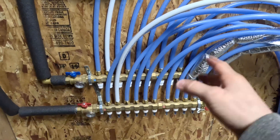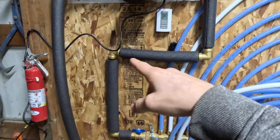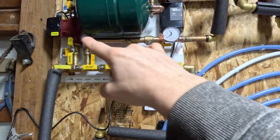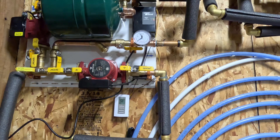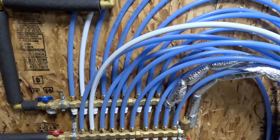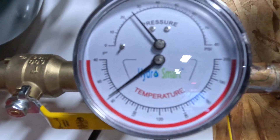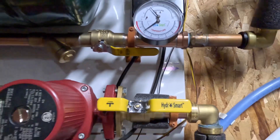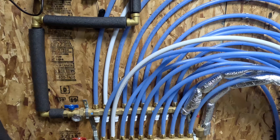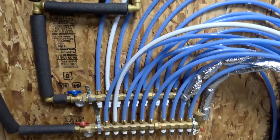I had to re-bleed all the snow melt lines that go into the concrete individually — shut those off, bled the whole manifold, then did this loop here, shut all that off, did the main loop up top. I did all that about twice to make sure all the air is out. She's holding good at about 25 pounds of pressure, which is about what I had last time. I've had it running for maybe 10 minutes — everything looks pretty good.